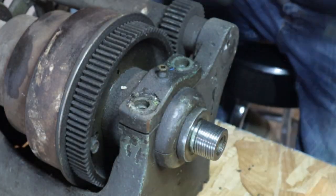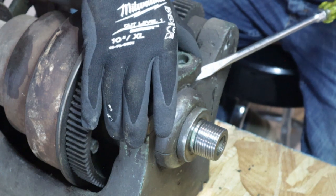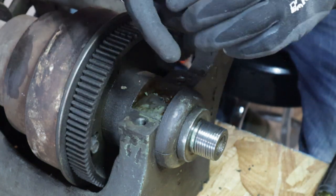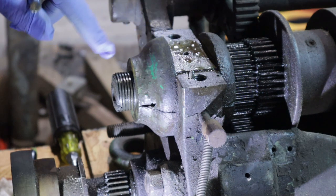I don't mind the patina of years on things, but I figured we might as well do this project right and do it nice. It looks like whoever had it before me must have taken the time to really take care of it. Now we can see what kind of shape these old babbit bearings are in. I'm really curious — if they're original, they should be lead poured. I have to get these babbit bearings apart, but we want to get them apart without damaging them.